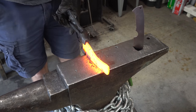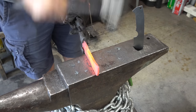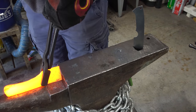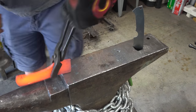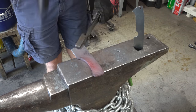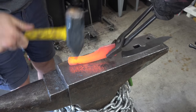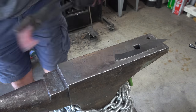In an upcoming Triple T I'm going to continue my beginner series and we're going to talk about forging — all about hammers, tongs, and technique. Here I'm using the step on the anvil to put that curve in the handle. Now I'm switching from my rounding hammer to a cross-peen hammer. The cross-peen is great for spreading out a specific area, and that's what I'm doing right here.